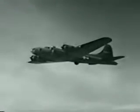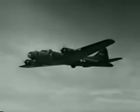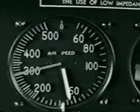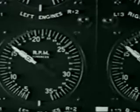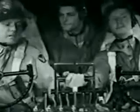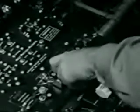You level off at 10,000 feet and cut her down to the proper setting for maximum long-range performance on 91 grade fuel. Manifold pressure down first to 28 inches. RPM next. You make this adjustment with one eye on the airspeed indicator because you use whatever RPM needed to get 150 miles per hour indicated. In this case, with your conditions, 1600 RPM. Then fuel mixtures to auto lean. And your co-pilot closes cowl flaps since you have a safe margin in head temperatures.